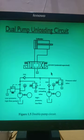Now what is done in case of the dual pump hydraulic pump? So there are two pumps. One is the low pressure high discharge pump. Another is the high pressure low discharge pump. And this is the motor for pump number one. This is the motor for pump number two.